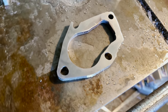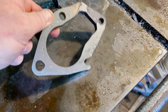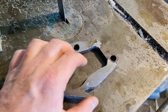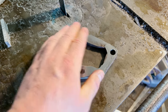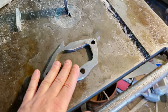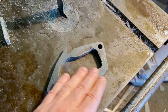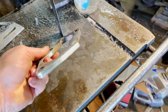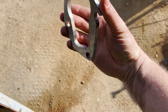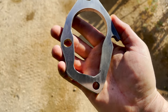I'm getting pretty close. I've been working it on this sander and had good luck making pretty flat flanges. Here's the backside — I started with this and got pretty close. I realized I might be able to just do this in entirety. I've got some stuff that hasn't quite ground out, but it lays flat on the table, doesn't rock. Using a lot of water, keeping it cool — as you finish off you want to keep the heat down so it'll lay flat. I think I'm going to be able to just do it by hand. There it is — came out really pretty darn good. Pretty happy with that. I've got to weld it up and then reface it again.